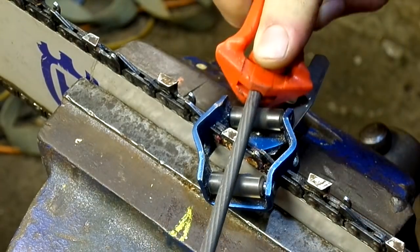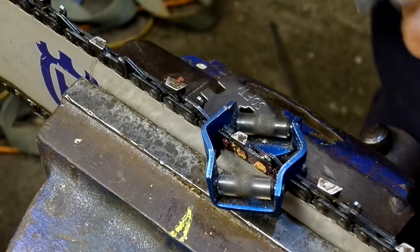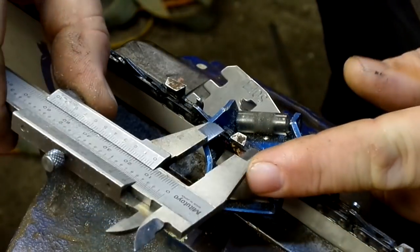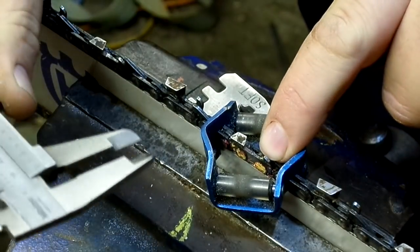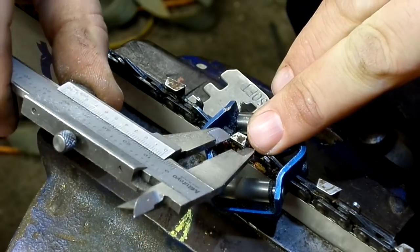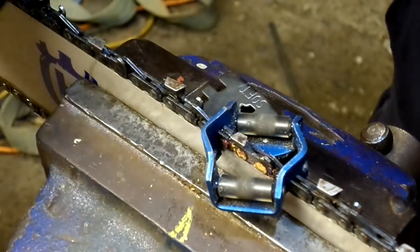I've already run these ones through, but that's as easy as it is. I'll go to one that I haven't done. Another thing I'll show you — I use a vernier caliper for measuring the teeth, the tooth. I'm pretty much getting all of them; a few mil out is not very much difference. The depth gauge is what will make you have a curved cut if they're wrong, because one side is taking off more than the other. So I set them like that, lock it up, just so it fits over the tooth, and you can't go wrong then.